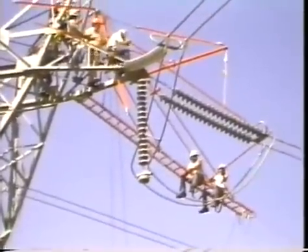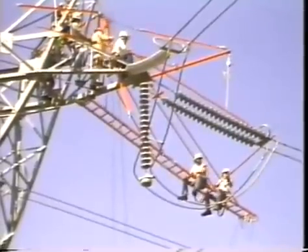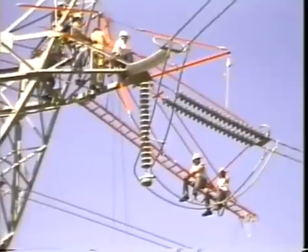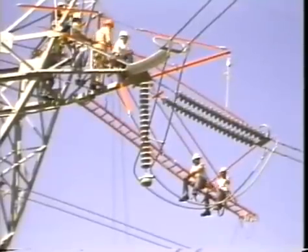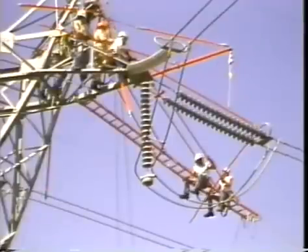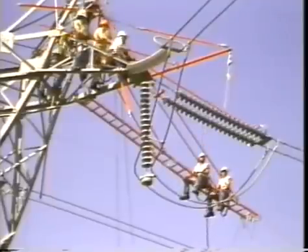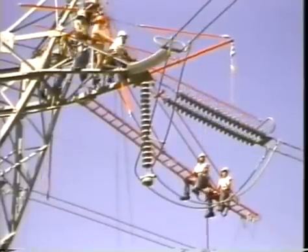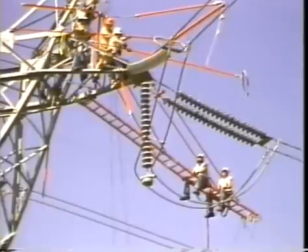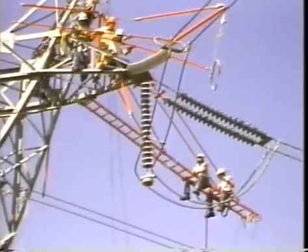As the corona ring gets removed, a plastisol coated fuse puller tool carries it on a universal pole supported by the boom while a ratchet wrench loosens the bolts to free the corona ring. The crew moves the boom to one side so it's not directly above the insulator string as the corona ring comes off and lowers out of the work area.